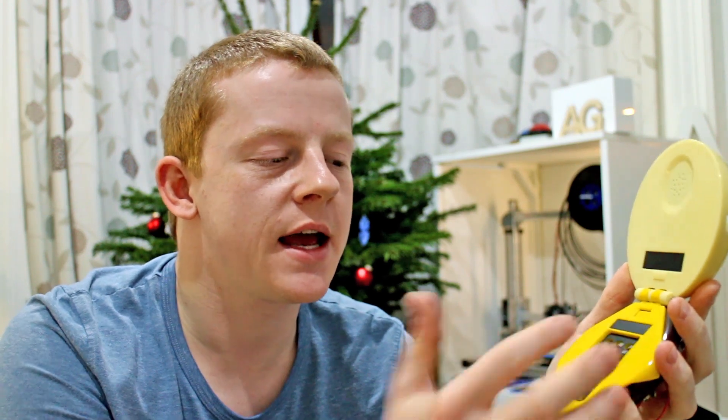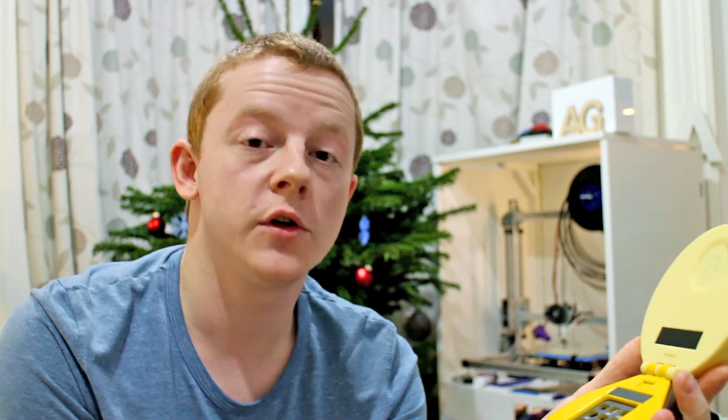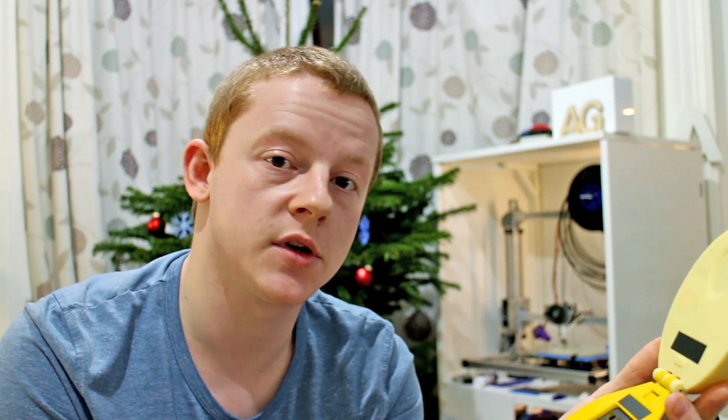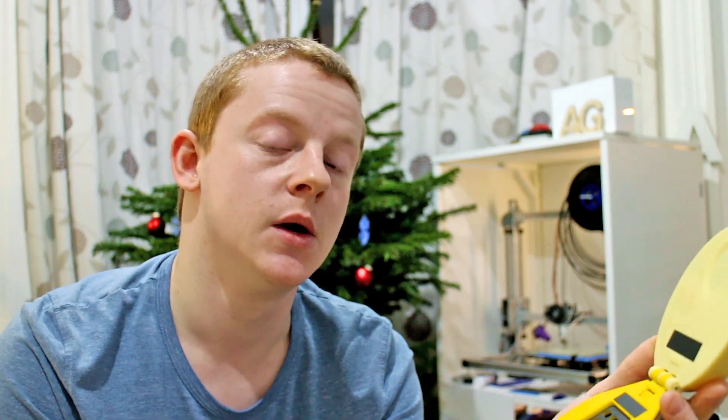With the Bluetooth hands-free kit, all you've really got is one button — I'm ignoring volume controls because I can do without. Going from a tiny earpiece to a big speaker like this it's going to be a lot quieter, but on full volume it's acceptable. You wouldn't want to drop it further, so volume controls are set to maximum. There's only one button which handles power on/off and making calls, and that needs to be brought through somehow.